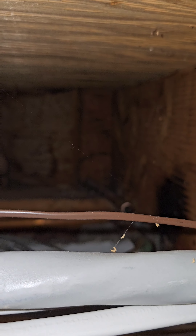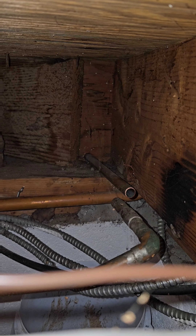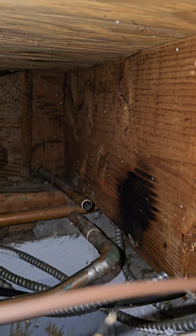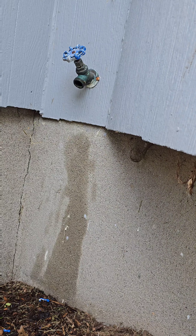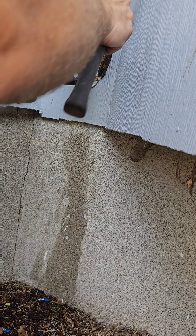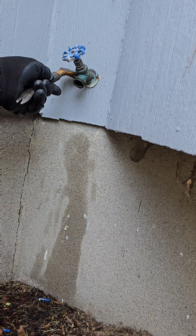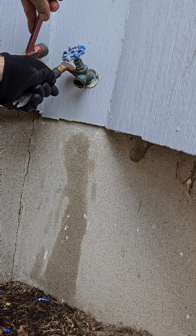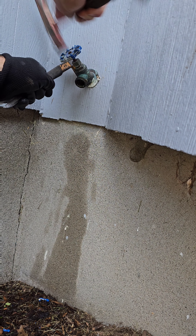It's a decent run - that spigot's a good 14 to 15 inches long of copper. I cut out the copper and my guy's outside pulling out the old spigot. You can see him - he's going to have to pull out the nails since back in the day they used nails, no screws. He pulls out the nail puller hammer, takes them out - comes out like nothing. He got one on each side.